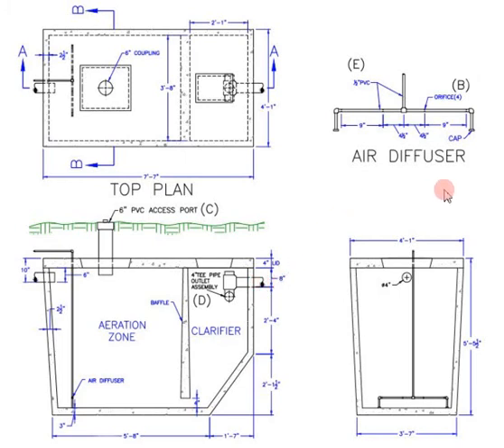The residential sewer treatment plant is normally 750 to 1,000 gallons by volume, but they are rated as 500-gallon plants. This is because the tanks are not rated by volume, but by the gallons per day that they can treat — so that the 500-gallon means 500 gallons per day, or as you will see on the label sometimes, 500-GPD.